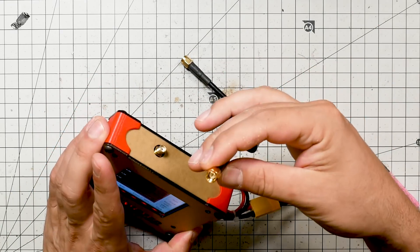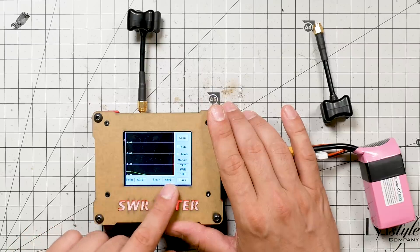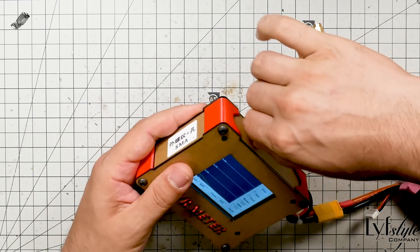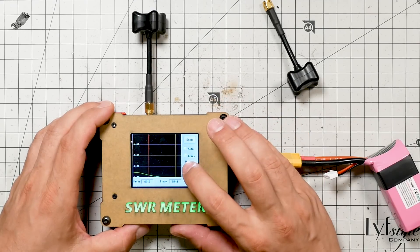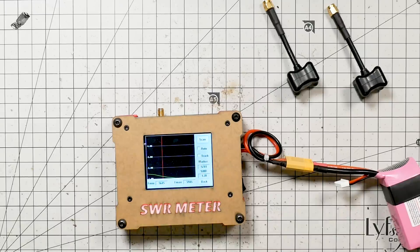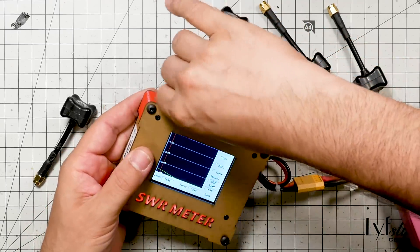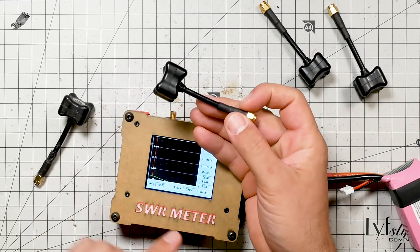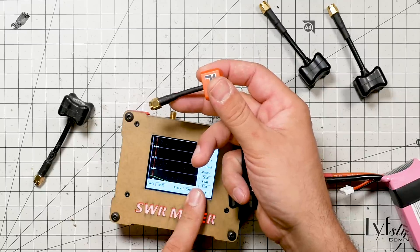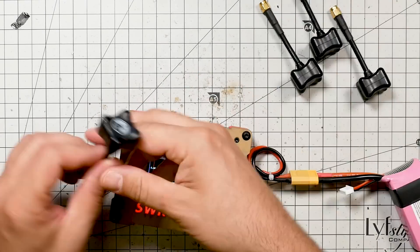These are TBS Triumphs — let's see what the results are. This Triumph is showing better SWR overall, at least within the capabilities of this device. It's doing a little bit worse down low and a little better up high. The Hoot at the high end was at about 2.0, whereas these Triumphs seem to be doing just a little better. This is really pointing out why some of the tests that we do are a little inadequate. If I were to test on a high channel, the Hoot would do a little bit worse and the Triumph would do way better; on a low channel, the Hoot would do a little bit better and the Triumph a little bit worse. Testing these things is complicated.